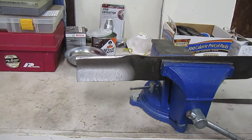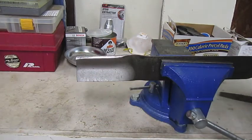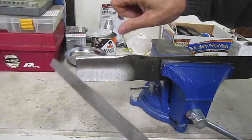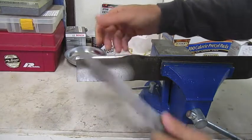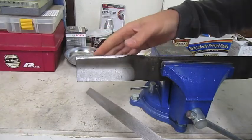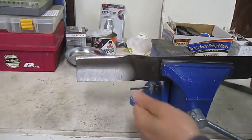Really, that's it. You don't have to drop your deck. I have an angle grinder, but I actually prefer not to use one, because if you screw up with an angle grinder, you could mess up your blade if you're not paying attention. With a file, it takes a little more time, but you have more control over how you sharpen the edge and get it where you want it. There's less chance of damaging the blade with a file versus an angle grinder.